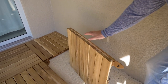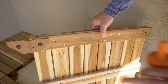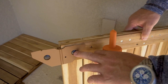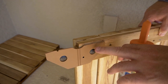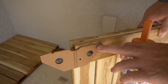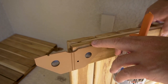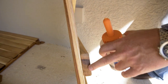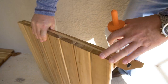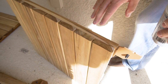We cut about a half inch off the deck tile. We didn't have to move the back board because the connector still caught the hole — still had plenty of meat right there. We trimmed a little bit off the deck tile connector with a razor knife or sheet metal shears, just so it wouldn't butt against the wall — you don't want that plastic protruding past the deck tile. You'll notice the end grain on the deck tiles is already sealed, because wood gains and loses moisture at a higher rate at the end grain. We want to coat it so it doesn't lose moisture too quickly.